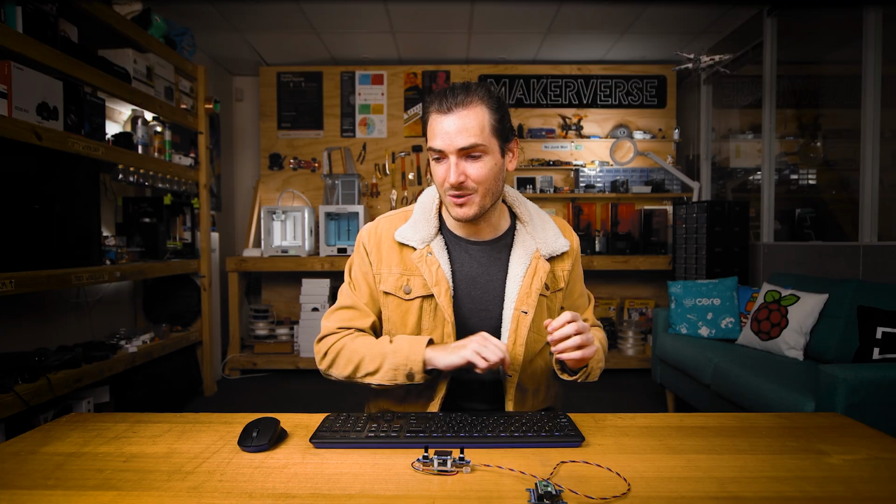Here's what we're going to do. Every time we detect a shake, we'll loop through every pixel on the display and essentially roll a dice. And I don't know, 20% of the time, we'll say that that pixel will get reset. So on the first shake, about 1 in 5 pixels will get reset. On the second shake, another 1 in 5. There may be overlaps, but eventually, if we keep shaking, that image should blur out to nothing.